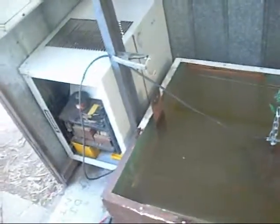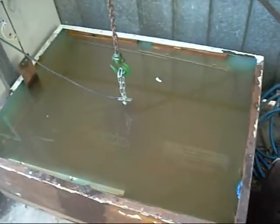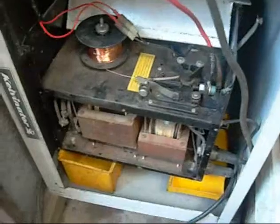We are dealing with dangerous current and voltage levels now that we're using a welder. 12 volts DC generally won't hurt you and 24 volts will give you a tingle, but we're dealing with about 75 volts here, so this is dangerous territory. I just did a couple of tests using different amp meters and coils and I can't get a reading above 20 amps, even at dead short. I've shorted it on the bolt a couple of times and it doesn't go above 20, so I'm guessing these amp meters only work on alternating current, not direct current. It's a shame — I was hoping to see what kind of amps I was running — but either way we'll turn it on and see what it does.